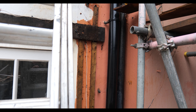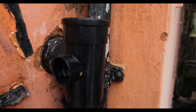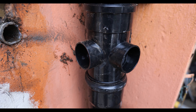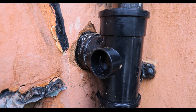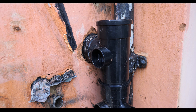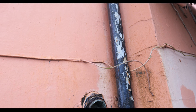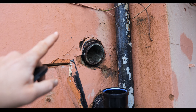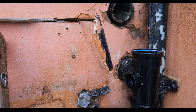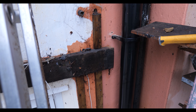The stack's all up now and we're putting the tee through the wall, which will pick up our toilet. I've left the boss in underneath just in case we need it, but I'm hoping the shower and basins will boss into the soil pipe on the inside, as that's underneath the finished floor level. Eventually we'll put another length of pipe up here with an air admittance valve, but I just want to make sure we can remove all the old pipes on the inside first. It was a bit of a wet one today but it's done and we can move on.